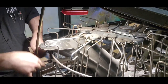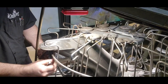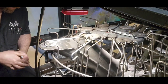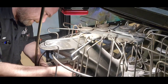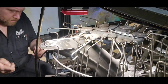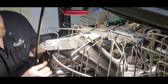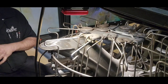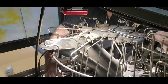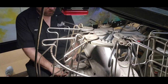Dueling speed wrenches — it's double fast. Use two speed wrenches and you go twice as fast. The interlock probe is spring urged rearward; we need to take that spring off and set it aside somewhere — not inside the circuit box. I'm going to keep the bolt and the nut with the interlock probe. We're going to go backwards a little bit so we can get this center chute pointed straight towards the front of the machine. That interlock probe we're just going to let it hang there.